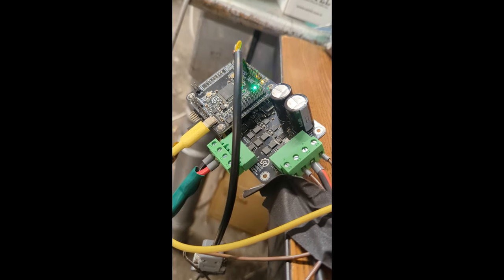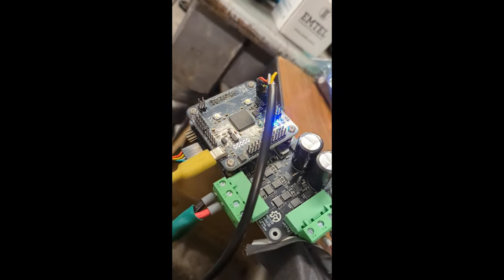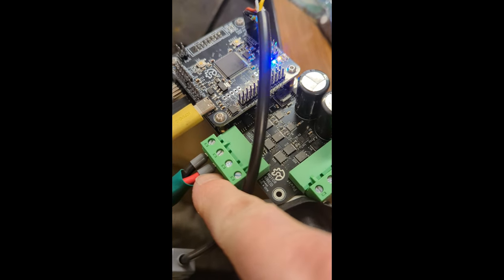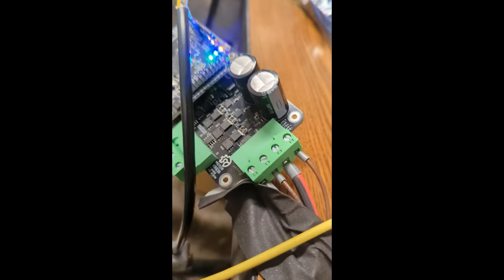OpenFFB board — nothing special, you all know what this is. That's down to the pedals. This is into the encoder right here. I've neglected to connect the differential wires — it's not a big deal. USB. This is the power out to the motor, just positive and negative. It's a DC brushed motor. Keep on hating — it works great.